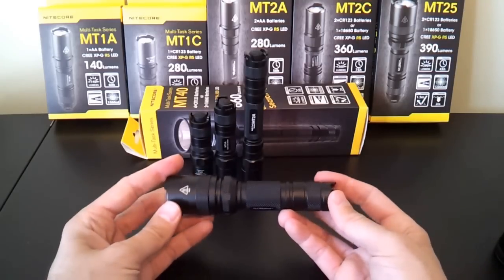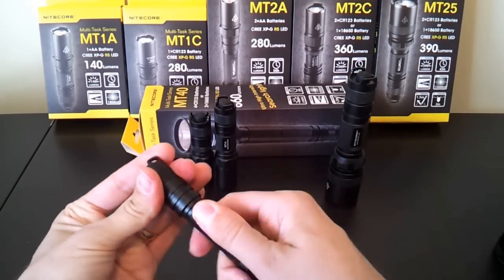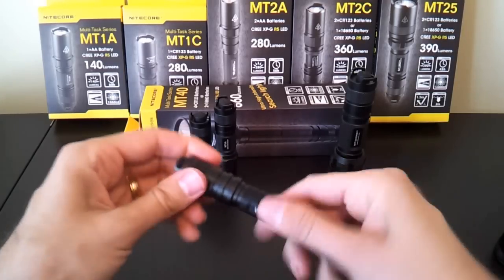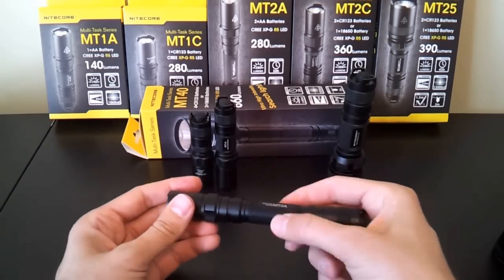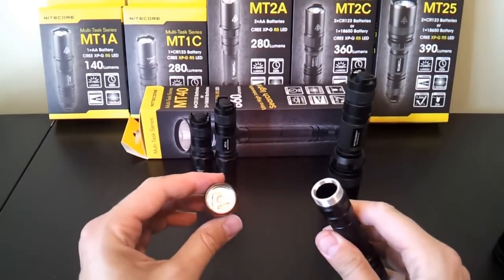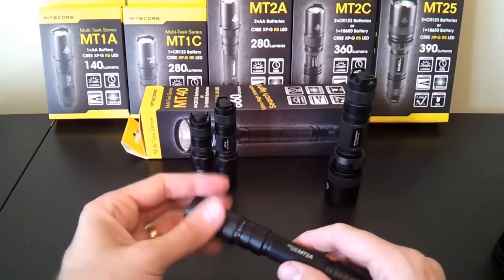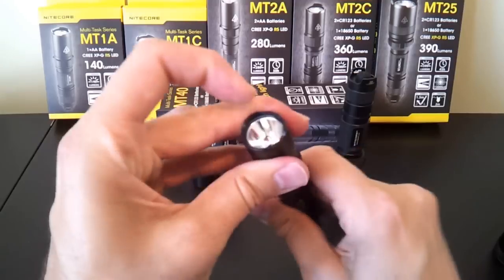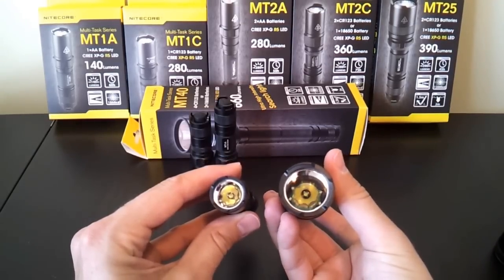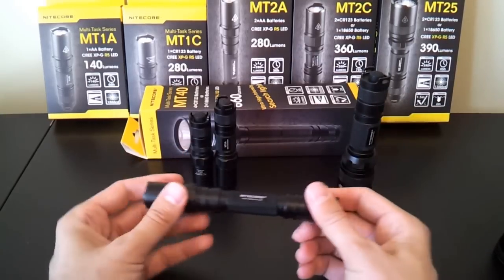Overall the build is very similar to the JetBeam professional series lights, and the characteristics are very similar across all models, with some knurling on the body. On the smaller sizes there can be some interchangeability of tail caps since threading is the same. They all have smooth reflectors. A comment on the emitters: they're not bad, but they're not necessarily perfectly centered — I can see some slight variation from one sample to the next, though it really shouldn't affect the beam very much. The lights can headstand as well as tailstand, though they may be slightly wobbly depending on the individual switch.